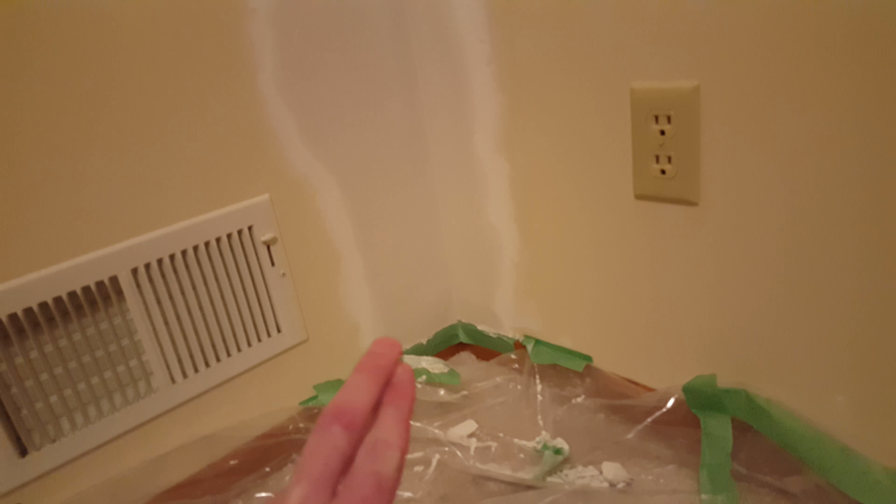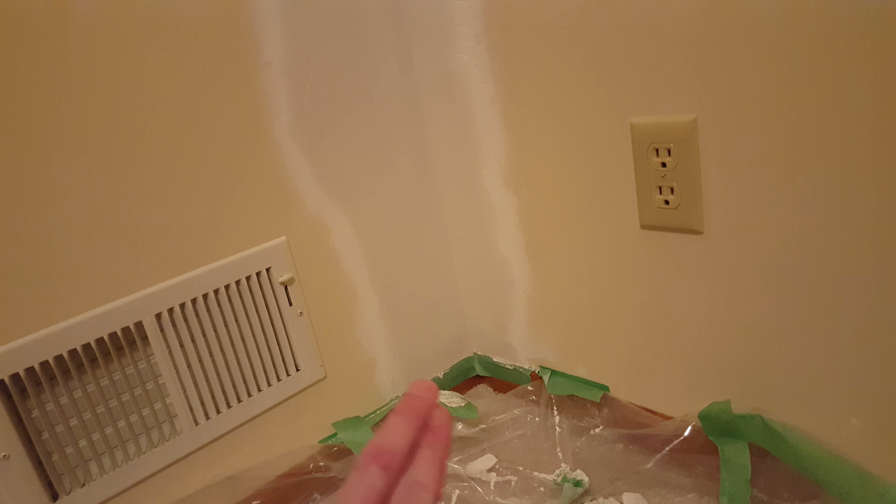The important part here is you're going to have to find out where your studs are. Hopefully they're real close to the edge — they were on this wall, but they were a little difficult to find on this wall. So just FYI: screw into your studs evenly spaced — this is an eight-foot ceiling — so you lock down these edges so they don't move. That movement is what can potentially create a crack in the wall down the road. If you have that kind of serious settling problem going on, you should probably look into it and head it off before trying to fix the smaller problems.